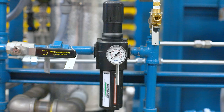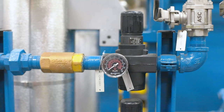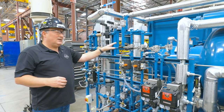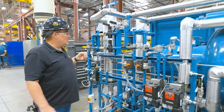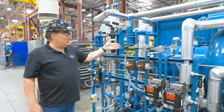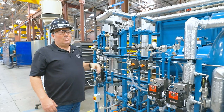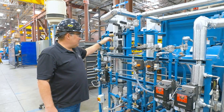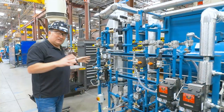Lastly, we have compressed air and also high-pressure nitrogen that we use for pressurizing autoclaves. These pipes will generally be larger schedule — and schedule reflects the thickness of the pipe and its ability to contain higher pressures. Depending on the pressure of the autoclave, you might jump from schedule 40 up to schedule 80, which is a higher-pressure piping rating. You'll see things like check valves and regulators and a lot of other gauges — there are lots and lots of different components that you're going to learn about.